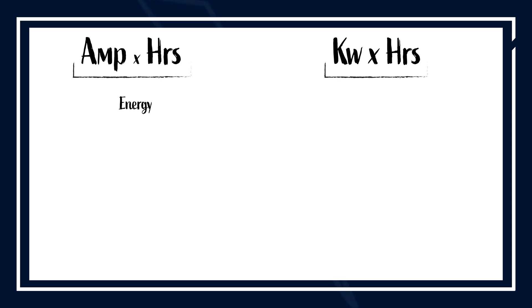This is in fact a total energy, because it's power times time. This is very similar to kilowatt hours, because that is also power times time — also an energy. The only difference is that amp hours carry an assumption of a voltage. On our boat, we have a 12-volt nominal battery bank, so we are assuming we're using 12 volts with that certain amperage we're recording.